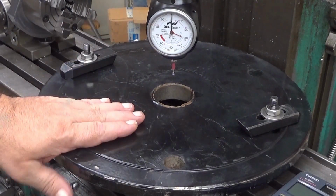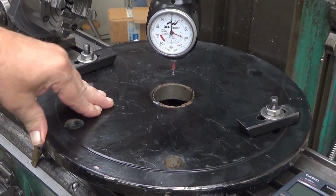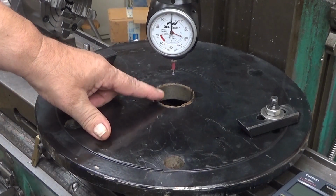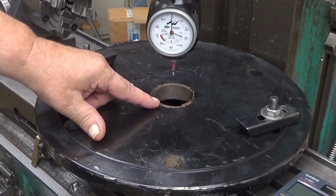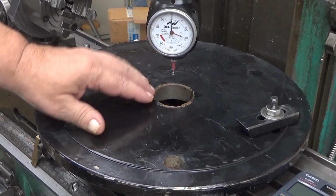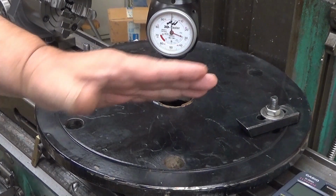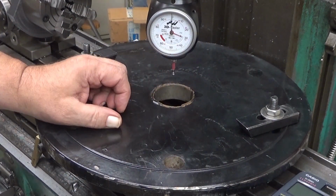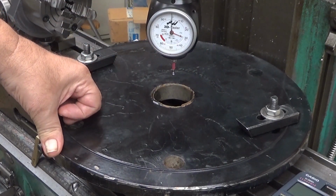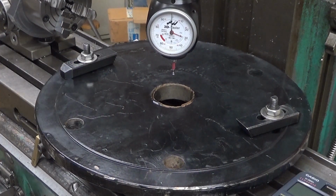This is one of the blades. They are 40 centimeters in diameter and 25 millimeters thick, and that hole is what I was talking about. You can see how the weld has been broken here. We are going to clean this surface and also make the bore consistent. Now it's somewhat rounded. It should be straight and with precise diameter. So our first task is to dial this in.